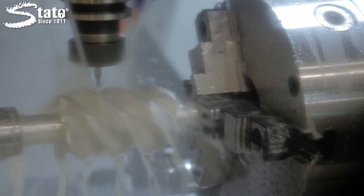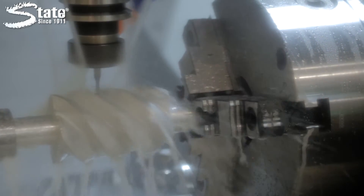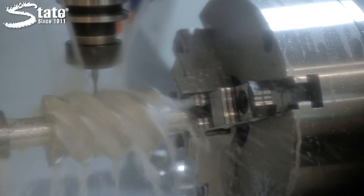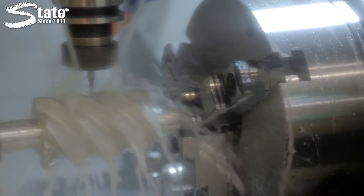The Cut and Cool anti-souring system inhibits microbial growth, which causes de-emulsification of oil in the system, and provides for longer sump life. Tramp oil may be wet vacuumed off the top of the reservoir without disturbing the system to extend the sump life even longer.